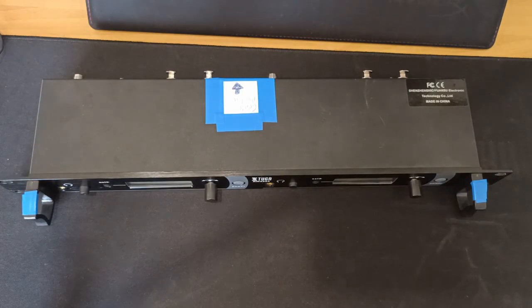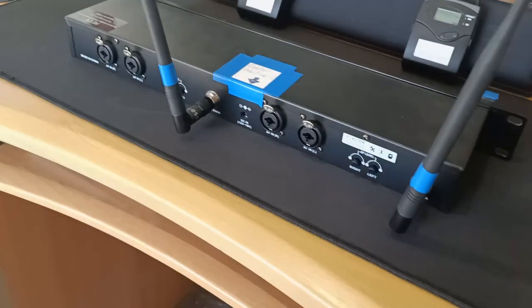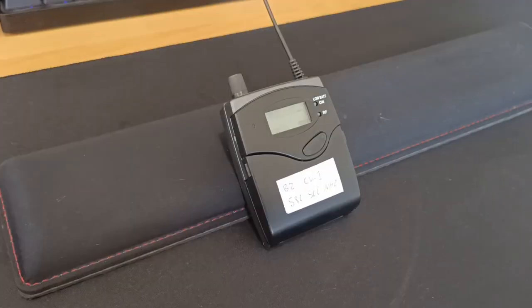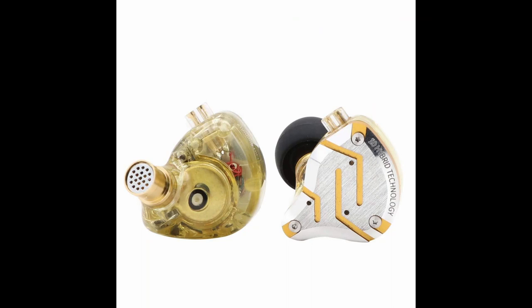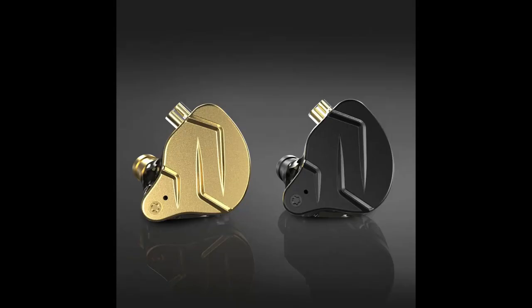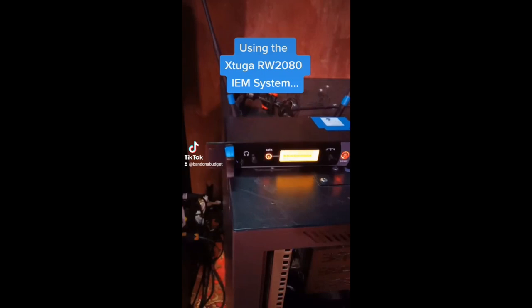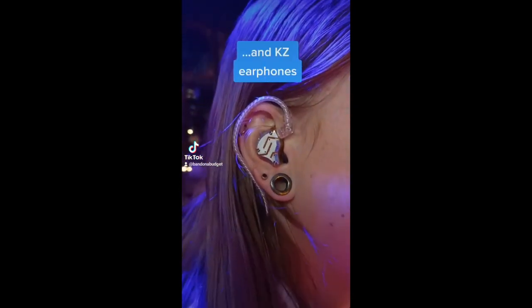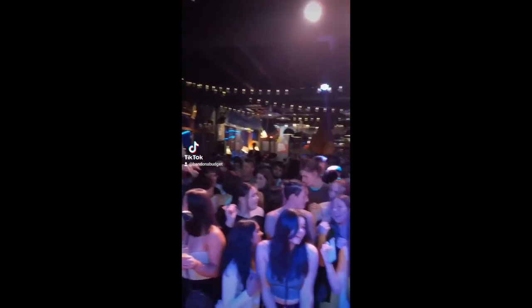So let's talk about the sound. There is some hissing noise generated from the receivers once your earphones are in, but once the music starts playing you probably won't hear it anyway — I certainly don't. Other than the hissing, the sound quality of the audio going from the transmitter to the in-ear monitor receivers is actually quite good for a cheap in-ear monitor system. I've been using a range of KZ earphones and they work fine for me. I still would have loved a stereo mix from the receivers into my earphones — it would have provided a better soundscape with more balance and presence on stage, and it can sometimes be a bit disorientating with a mono mix in your ears. To overcome this, you can set up a microphone on stage to capture the ambient noise and stage presence and just have that fed into your in-ear monitors. In terms of range and distance, I was able to walk around my house and outside down the driveway and still hear an audio signal before it started to drop out — range probably maxed out at about 50 meters.